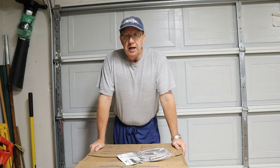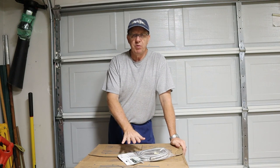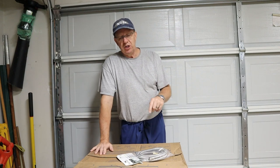With that in mind, probably a couple hours and minimal tools, you can save yourself 140 bucks. They're not very heavy — I picked this one up myself and brought it in. When you go to buy a dishwasher, the things you need to look for are the dimensions. First, measure what the opening is in your cabinet side to side and from the floor to the bottom of the countertop. When you measure floor to countertop, take the measurement from the highest point on the floor, because some floors are tiled up to the kitchen cabinets.